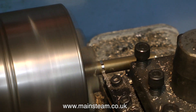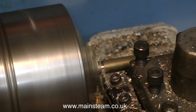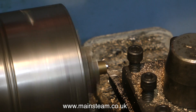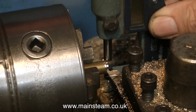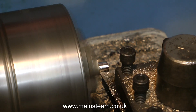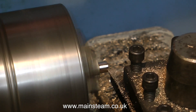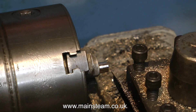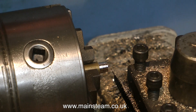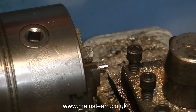I'm not parting off all the way through, because I do not want the bit to drop off into the tray — when you pick it up you get lots of pieces of brass stuck in your fingers. These little golden pieces of brass are really sharp and can be surprisingly painful. I'm now turning this piece down to 5/16ths of an inch, checking it frequently with the micrometer, and I do stop the lathe before I apply the micrometer.